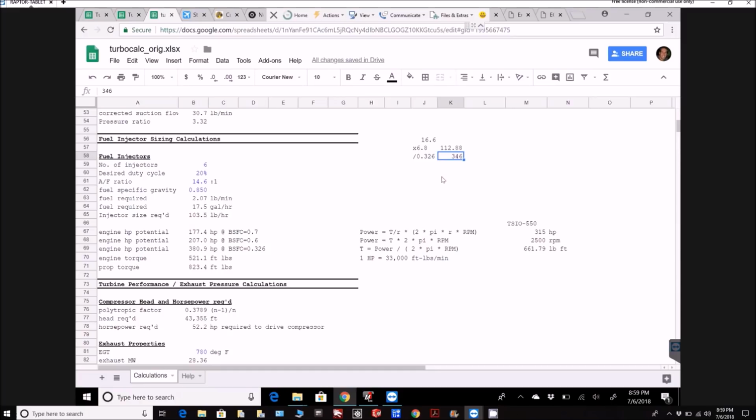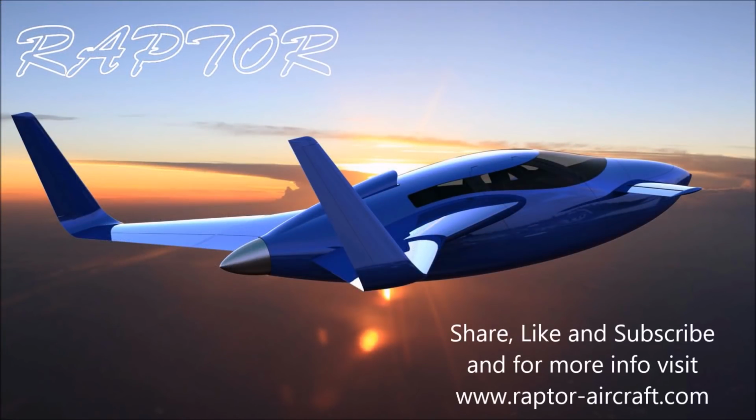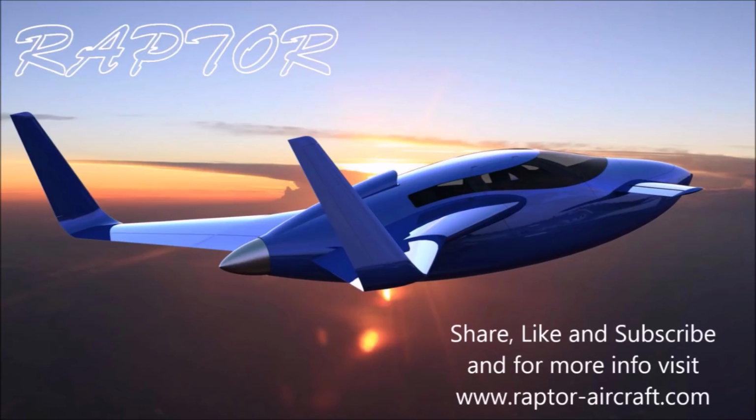And so the next thing I still have to do is run some new injector profiles that Motec has put out for the Bosch injectors. So that'll be what's happening next, and we'll see if that makes any difference. But overall, I'm super happy with how the engine's performing now. We're getting the power that I thought, because the fuel flow is there now to back it up.